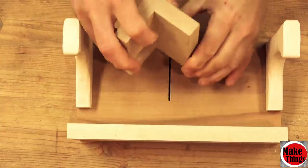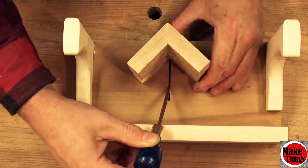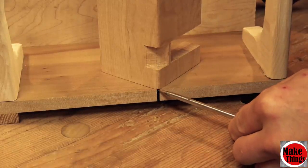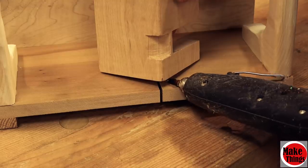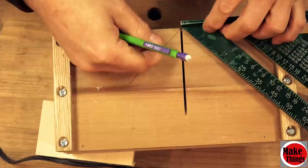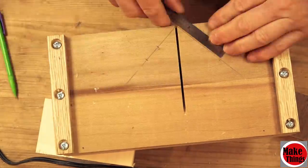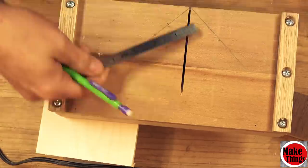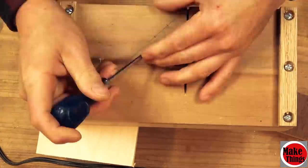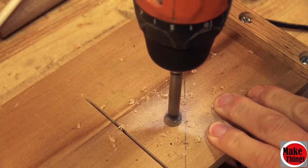This is the most difficult part of our split dowel setup. We'll want the cradle to sit perfectly in the path of the blade — a sixteenth of an inch one way or the other will make it look off, so you really want to spend the time centering it on both the front and the back of the mitered cradle. I used a little hot glue to hold it in place. Due to the screws I was using, I used a Forstner bit as a countersink.